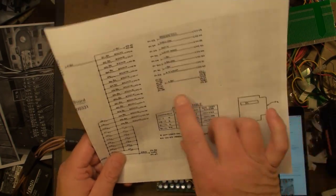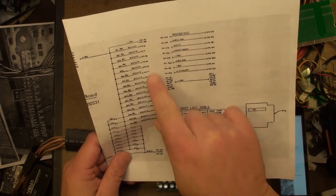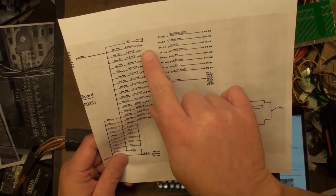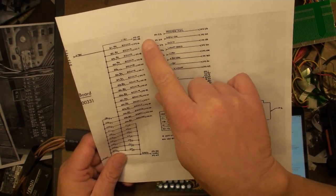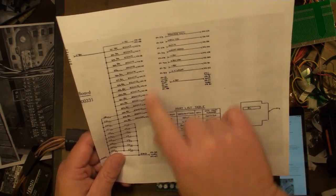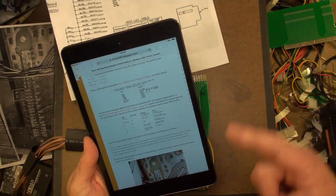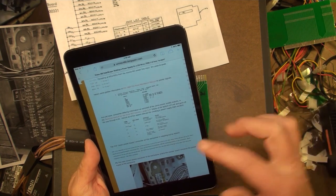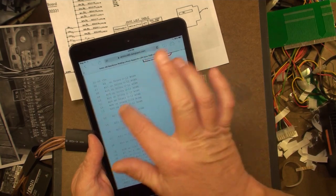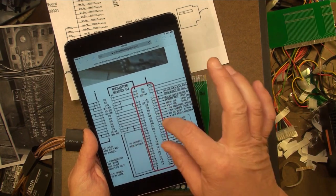The major components are 8-ohm resistors at what I think is 3 watts. I found another source that called these 8-ohm at 3 percent, but this source calls them 8-ohm at 3 watts, so we're going to go with 3 watts - which makes more sense. Pretty stout resistors, and 16 of them. Basically one end of each resistor is connected to plus 15 volts, the other end to all of the inhibit pins - all 16 of them. It says which connectors they go to: 6, 7, 8, 9, 10, 11, 12, 13, 14, 15, 16, all the way through 21. There's another chart showing where that goes on the connectors. I've extracted and mapped all of that out.